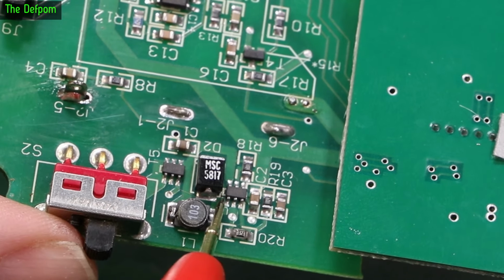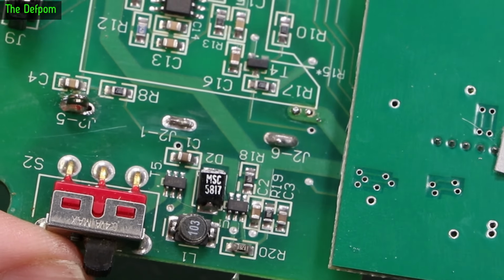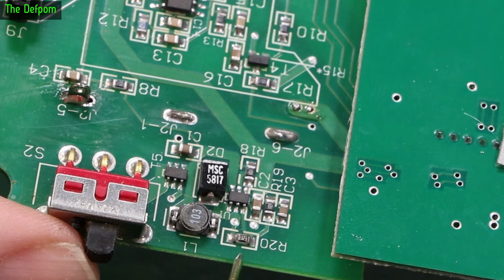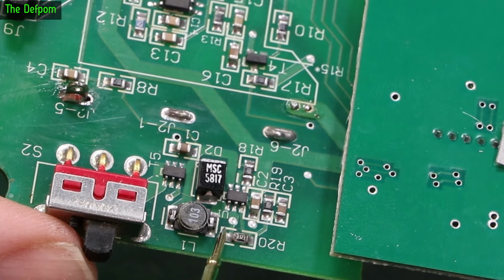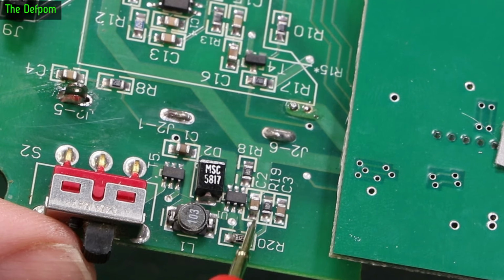So this chip here, I think, is a switcher. It's marked as LTUN. I've got no idea what that is yet. I haven't tried to look it up. And here we've got a resistor, which is potentially in the feedback path. I need to check all this circuitry out yet. But it's connected to this point, which makes me think this could be feedback.